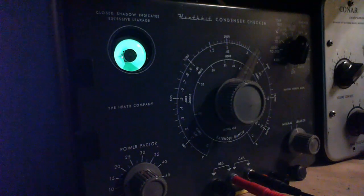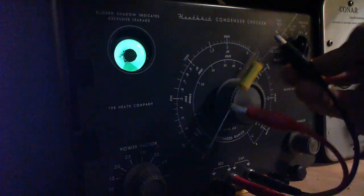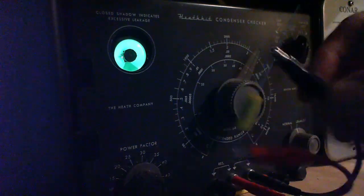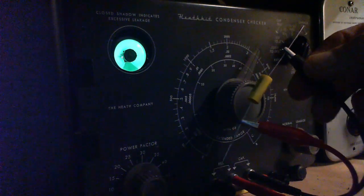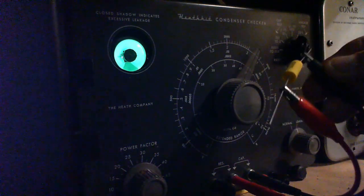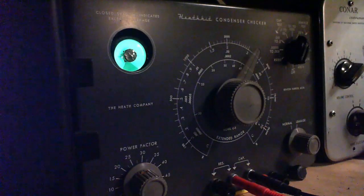Happy to do that once in a while just to double-check. I just put around 400 volts on this capacitor very briefly, but it could retain that voltage. When you let go of this control, the machine puts a short on it. The general rule is the length of time you spend charging the capacitor should equal the time you spend discharging it — especially electrolytic capacitors. If you think the momentary discharge drains it, not really — that voltage can come back and get you.